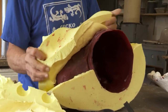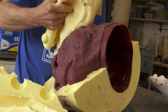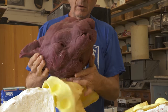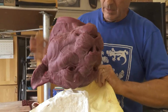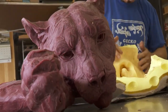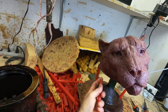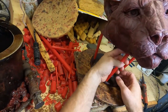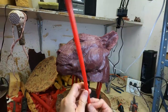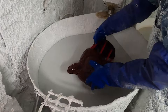What you're seeing here is the rubber mold that has been made of Simba. Jeff Christensen, the mold maker, is pulling out the wax that was reproduced from that mold. This illustrates the series of positives and negatives in the casting process — the wax is now a positive that comes from the mold. The various colored waxes being put on the head are sprues that allow the bronze to flow properly into the head.